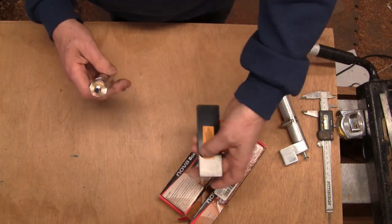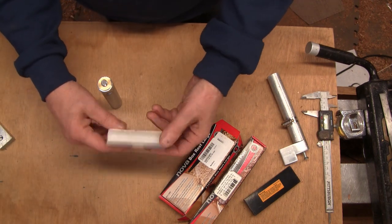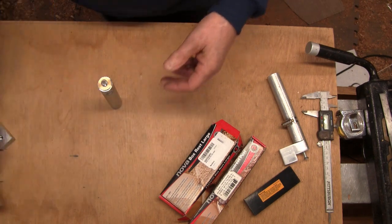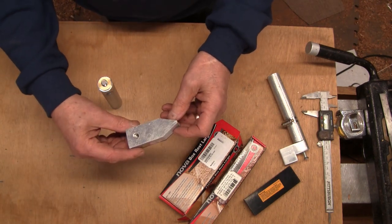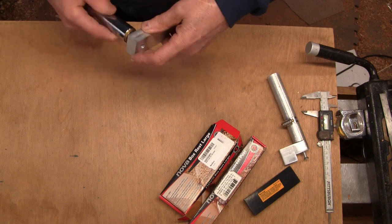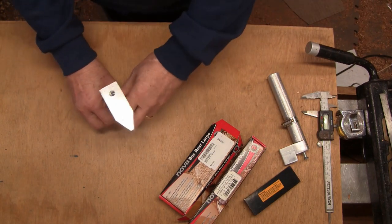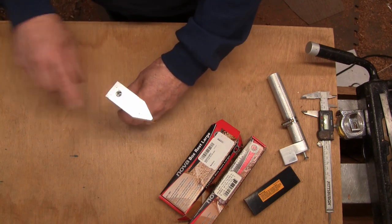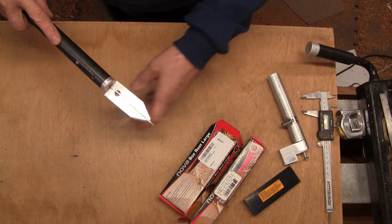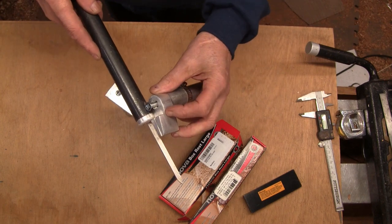This one is called the large. I bought it because I felt I could use it for its intended use and get better use out of the long one. The short one is an inch shorter — that's what I would get if I was making the ring cutting jig. I'm going to take this off and put a piece of aluminum on it that I cut out, because I don't want to cut up and drill holes in the purchased piece. I have this scrap of aluminum marked out — that's going to be a hole in it and it will go on here. Now, the parting tool is going to hit here and you're not going to be able to get much of a cut. Just like on this one, I put a step in it so I could get farther through the cut.